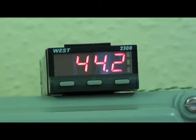In this demonstration I have two relay outputs: a low alarm set at 20 and an upper alarm set at 50. If I go to the upper alarm, the relay engages and the red alarm light comes on. Going back out of alarm, it goes off. If I go to the lower alarm value of 20, the alarm comes on and then back out again.